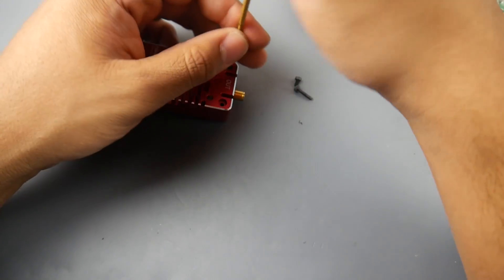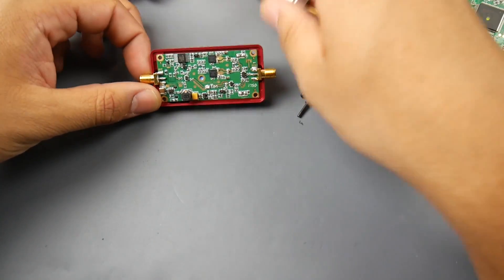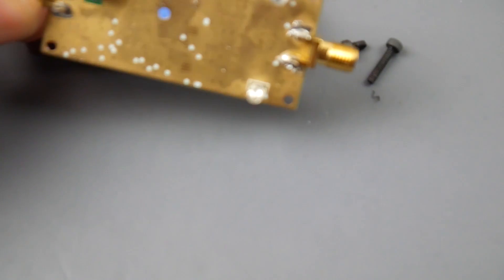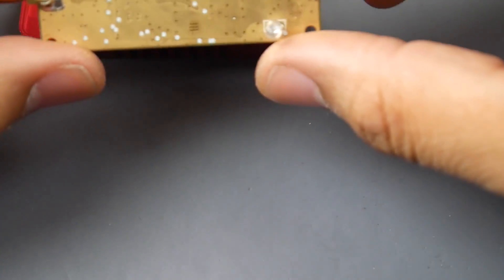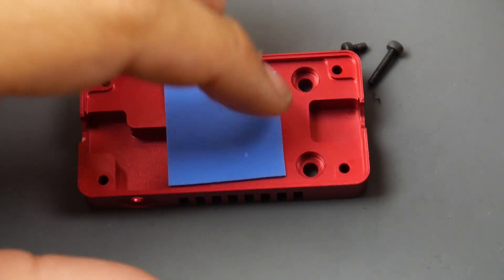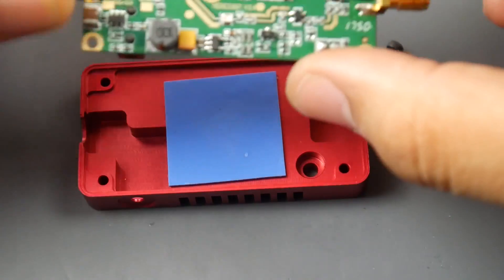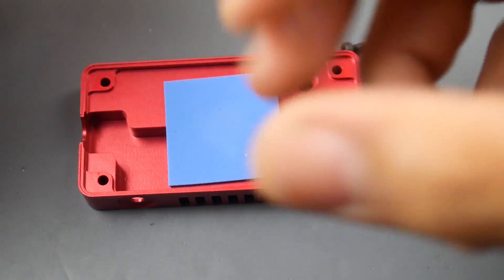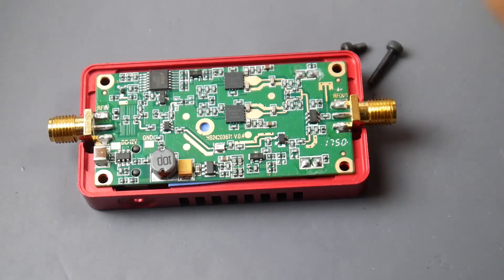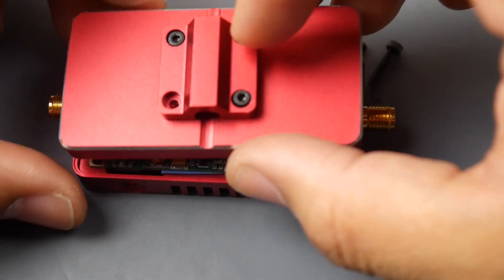It's important to make sure it can amplify the lower 2.4 gigahertz frequencies, because that's what our transmitters actually operate on. Once we pull the cover off, we're greeted with a large copper plate on the bottom for heat dissipation, since this thing should get pretty toasty. On the other side of the heat sink they're using a thermal sticker, but I'd prefer thermal paste. Once I start testing, I'll check temperatures and possibly swap it for CPU thermal compound. We also have the option to remove and reinstall it very easily.